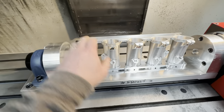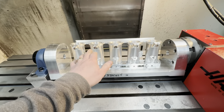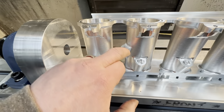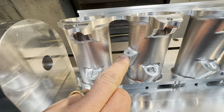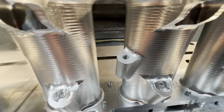So you'll notice we came in and we done the top sections — we faced these off, we drilled and tapped, we done our undercut. I did come in on the other video and used a little 10mm ball nose tool and I've done a load of step overs to flat off this face, which is for the fuel rail. It's done the job and it's left a good finish.